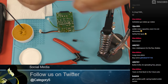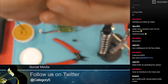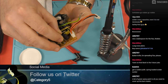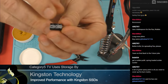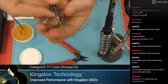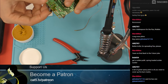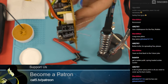I've got two replacement capacitors — same thing, 10-volt, 1,000 microfarads. You'll notice that it has a negative side, and it's important to make sure that you get the polarity correct. Notice the minus sign on one side — also the legs: the shorter one is negative and the longer one is positive. I've just bent the legs a little bit to hold them in place for soldering.